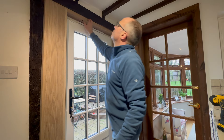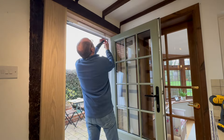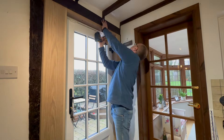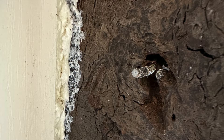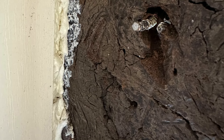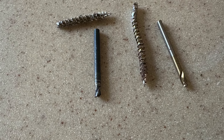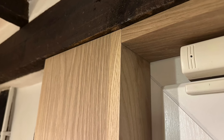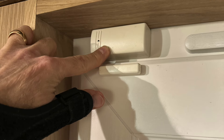So with the side piece back in, I can now make some tiny adjustments. The top bit's not 100% flush, so I'm going to take the screws out, get it flush, put the screws back in. Now what I didn't mention earlier on was how hard this oak is - I managed to break two screws and two drill bits trying to get fixings. It was incredibly hard. You may have noticed I've actually placed the top piece - I'd originally done it in 30mm but it was too wide and I couldn't get the alarm sensor to fit in between there and the door. So I had to replace it with a piece of 20mm, but it was an easy fix and easily overcome.